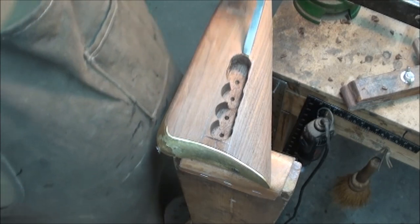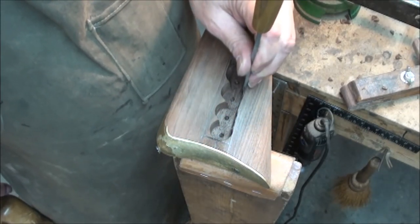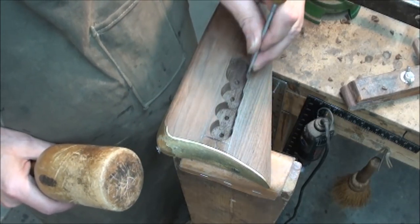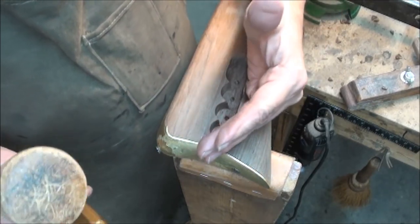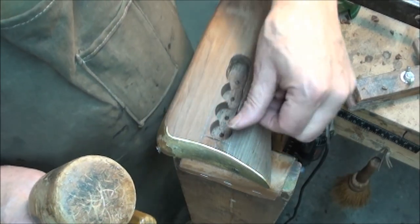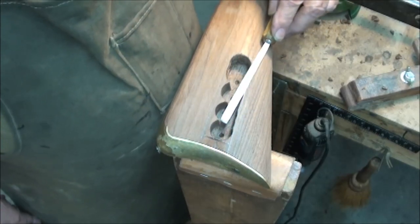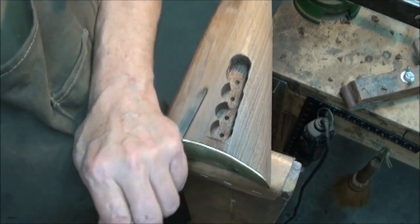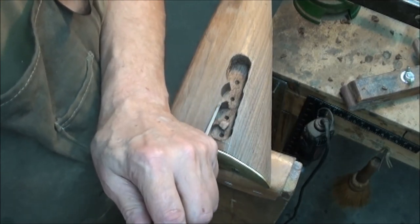When I do, I have to sort of stab down beside it like in any other inlet and work my way along. And I work from the front part to the back because the grain structure is running in that same direction. And if I try and start at the back and go forward, it'll want to chip out pieces at an angle, which I don't want to do. It'll come out sort of like that. This side would be a little easier. I can actually cut it this way. But the basic idea is just cut away the excess